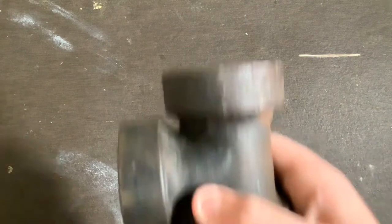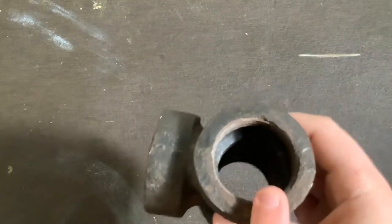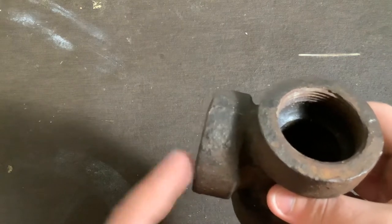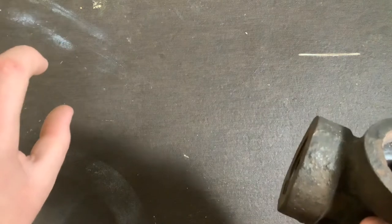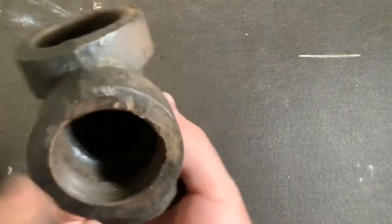The next fitting is this cast iron drainage T. It would connect to inch and a half male threaded pipe. This is screwed out of the drain, this is screwed into the vent, and then this would be the trap arm. What you put into the trap arm could really vary. In the 40s and 50s it would have typically been done with galvanized pipe, then you'd put a galvanized nipple in when you went out with a chrome or brass trap. In the 60s and 70s they might have used a male adapter made of PVC glued into a PVC pipe and gone out with a PVC trap. It says American Foundry on it, and you can see the direction of flow marked on it.